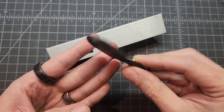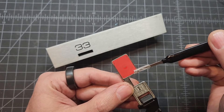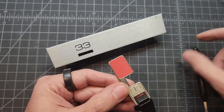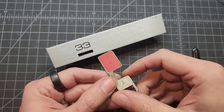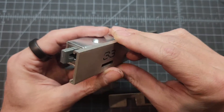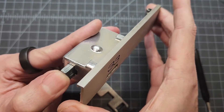First of all, this is the key. It's pretty cool. It flips out, and my understanding is that there are four magnets arranged around the perimeter here. I think the poles are aligned to a certain compass direction, and that interacts with rotors inside the lock to turn them to the same position, and then the mechanism can sort of unlock. If we take a look at this lock, you just see this slot — there's really nothing in there, it's just a void, and there's the bolt here. You basically just insert the key and slide it back, and that's all it is. That bolt doesn't throw.